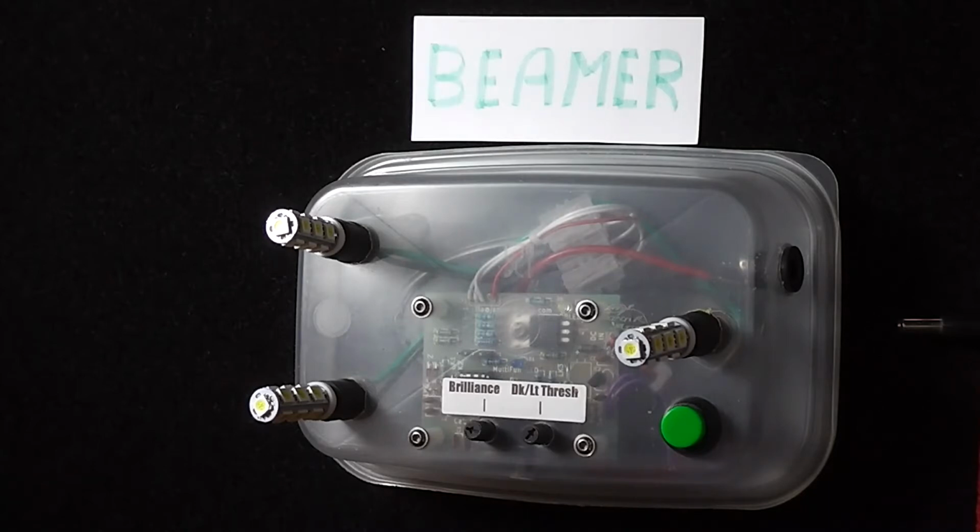Also, there is something I've explored within this unit that I found interesting, and that is that it doesn't use the usual light-dependent resistive light sensoring system. It uses a photodiode, and it switches off the LEDs before a measure is taken of the light level. This gets around the problem of feedback with normal Nightlight units, in that if, say for example, it's nighttime, if the threshold is achieved, the lights on a conventional Nightlight system will fire up.